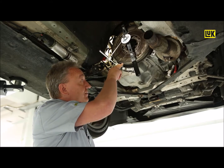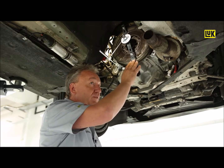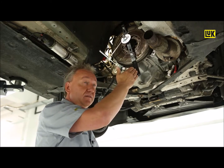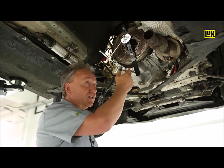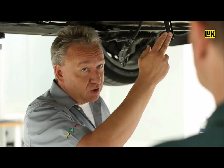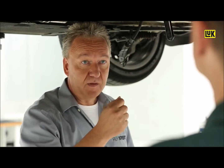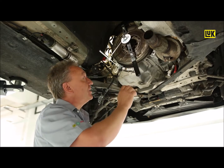There are two further differences. If there is an even number of clutch plate mounting bolts, I can centralize the slotted arm. If there is an odd number of mounting bolts, it cannot be fixed centrally — as a result, we can't check the degree gauge. Therefore, the next test method would be counting the teeth on the starter ring gear.